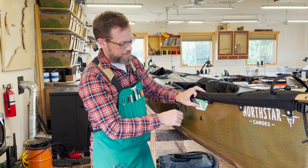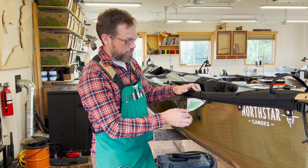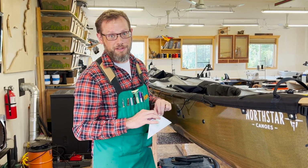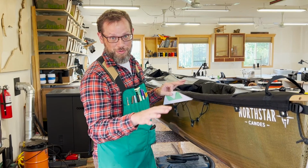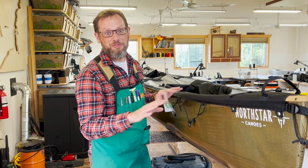Okay, that's 30 seconds holding the last SNAD adhesive snap on the boat. We'll take our template off, and now this is the hardest part of the entire installation. Don't snap these onto the boat, and don't unsnap these for 24 hours. Walk away, just leave, go home, it's over.